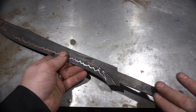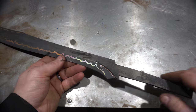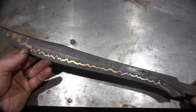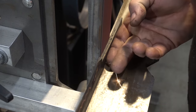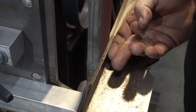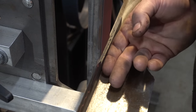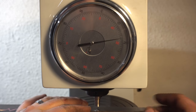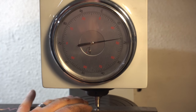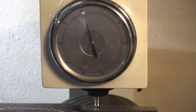So now I'm gonna grind a bit here and test the hardness of it, then we'll do final grinding. There's always a little bit of decarburization on the outside of the blade — you need to grind that off before you do a test. I should mention this is after temper; right out of the oil the blade was 65 HRC.